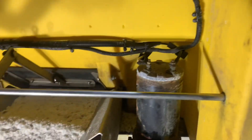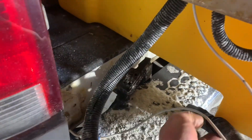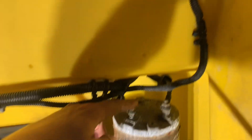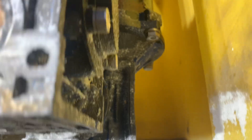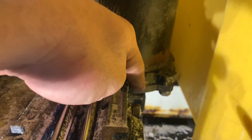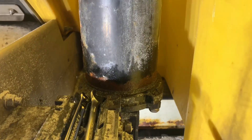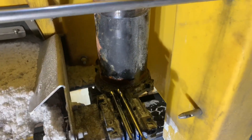To take this motor off, we're going to make sure the main plug for the salter is disconnected — it's coming from the truck. Then we'll take both terminal lugs off. Underneath the motor there are four bolts — two on each side. I went ahead and sprayed some WD-40 on here to help get this thing off, because last time it was quite a pain. I'm going to set you guys up on a time lapse and we'll get this motor out.